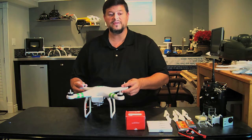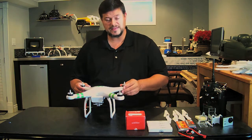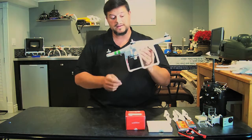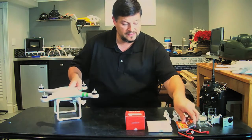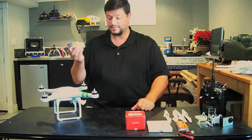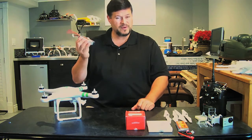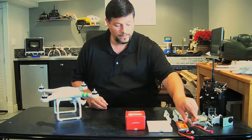I took the motors that came with bullet connectors, cut them off, and re-soldered the cables to the ESCs properly. For batteries, this shell comes with a very large, elongated battery compartment. I originally used 11.1V 3S 2200mAh 20C batteries and got about six minutes of hover time, with the battery not draining past 3.7V.